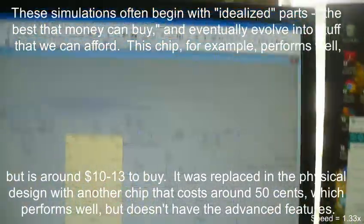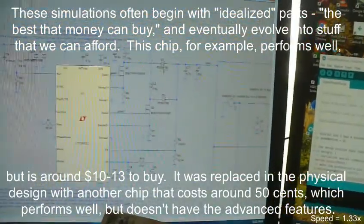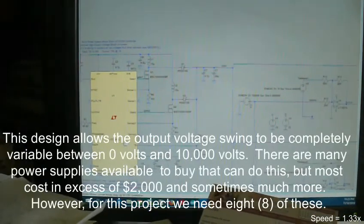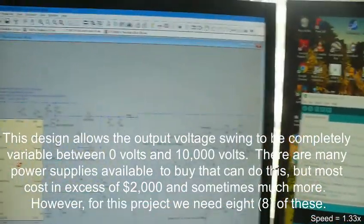The voltage spike gets pushed back through these two Schottky diodes right here, and that energy gets stored up in these two capacitors over here. That produces 100 volts on the output, a closely regulated voltage. It's regulated by this set of sense resistors down here. FB is feedback, so this chip controls what this output voltage is.